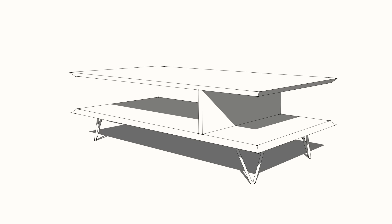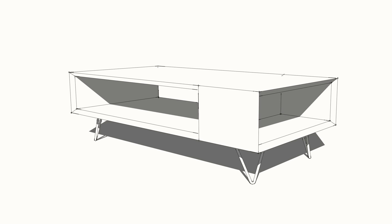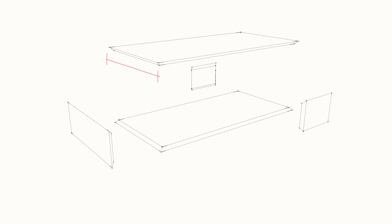So you really want to pay attention to the order of operation. The entire table is made up of six panels: a center panel that doesn't get a bevel cut, a bottom, top, back, and two sides. Let's ignore the center panel for now since we're going to cut that one last. The top, bottom, and back piece all have the same width, so cut that first.